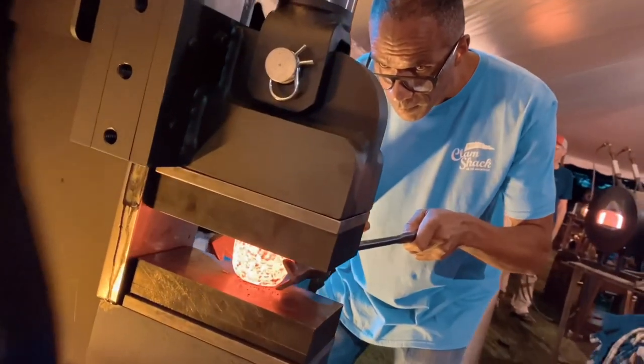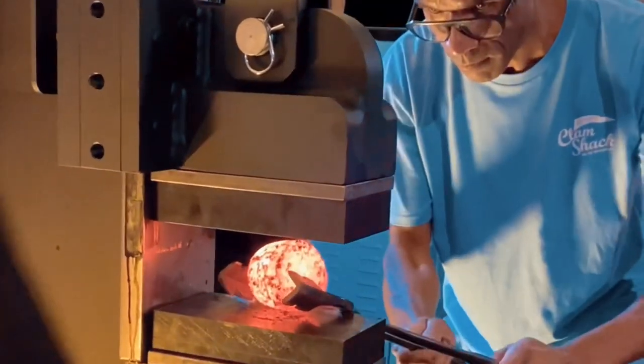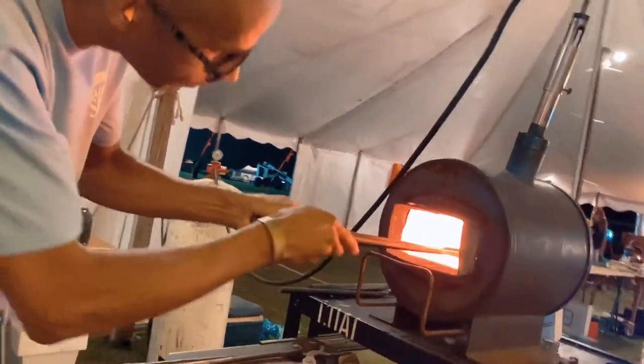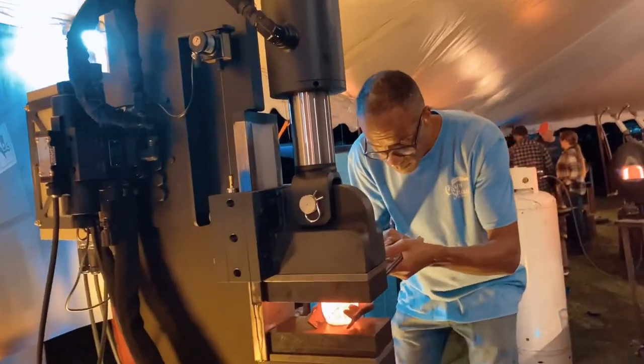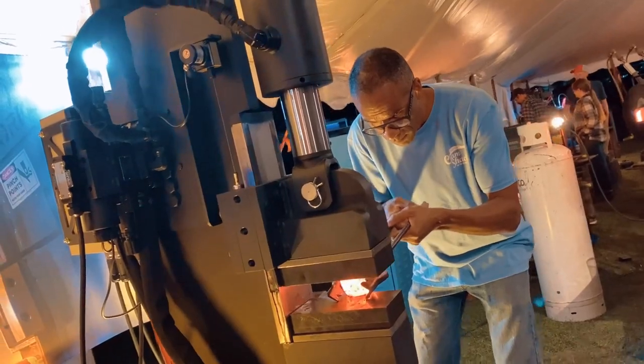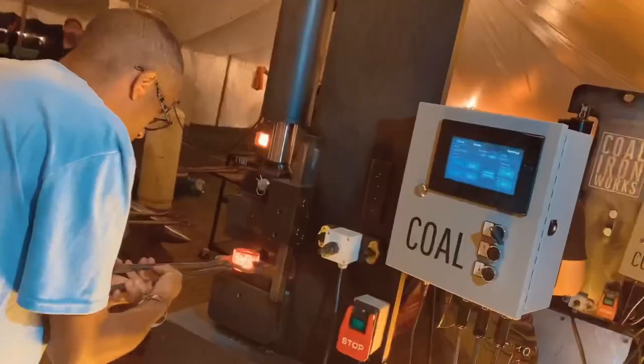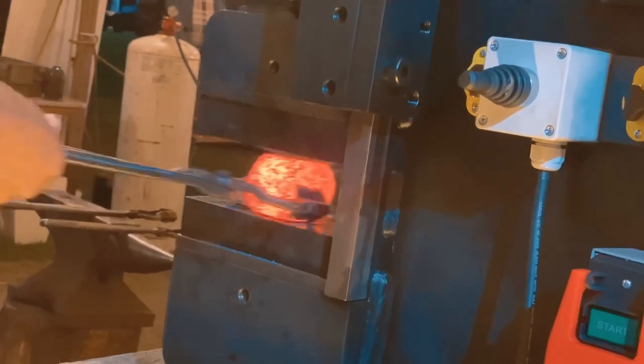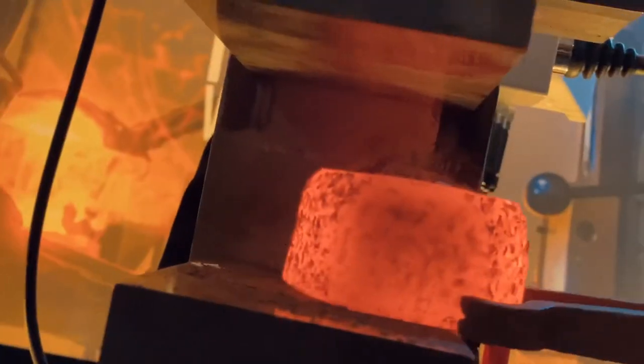First step with this is to get the material hot and just kind of touch it on all surfaces and see how the material behaves. It's high risk of fracture in the early stages of forging, so you really want to take it light. These big flat dies work great for that. Just a little touch, not so long to suck all the heat out of it, and not really pressing the same area more than once.